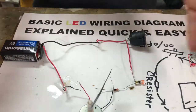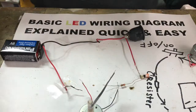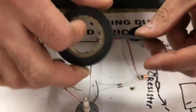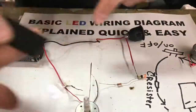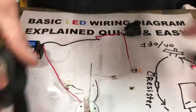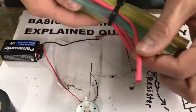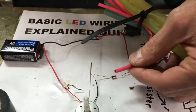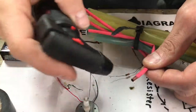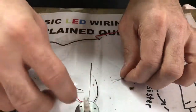There's a lot of nonsense on YouTube where people make videos just for ad money and they're really bad teachers. I don't know if I mentioned taping up your connections — if you're a beginner, you don't want positive and negative ever touching, so anywhere you've got bare wires, use a little bit of electrical tape. Also, there is a product called shrink tube: it's a tiny little tube you slide on beforehand, and you take a torch lighter or regular lighter and it shrinks the tube onto the wire. That's a really nice professional option.